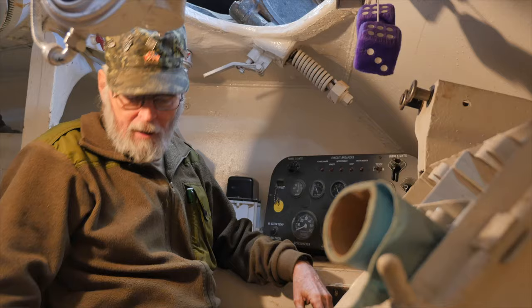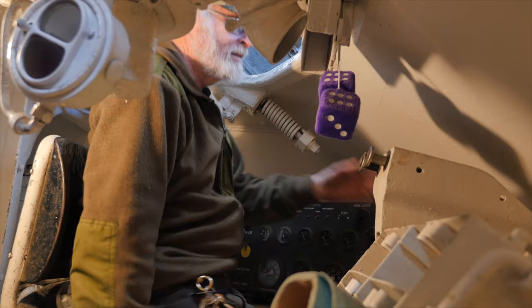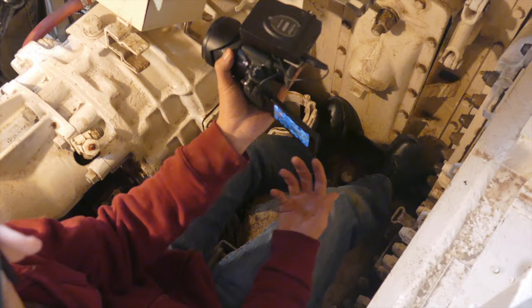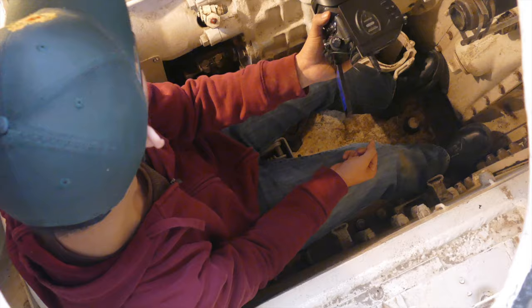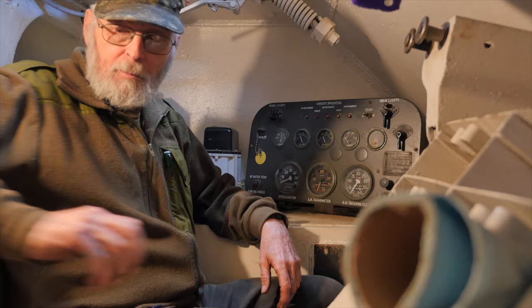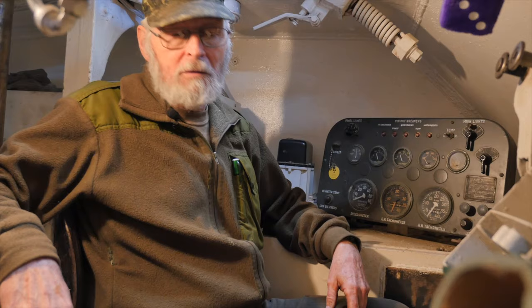With this seat I'm in the hatches-down position, but I can go up and drive so I can see out the top — or in the middle. Just depends on your height. Thanks a lot, Frank. But just sitting in here — this is exactly what we were talking about when we said it was hard for smaller people to drive the tank. For me, there's no way I'd be able to reach all the way forward to grab the tillers, and probably the gas pedals too. Frank notes the tillers aren't that bad — you can lean forward — but with shorter arms the long throw of the gear lever going from first up into second is a real problem. They've got a guy who's six foot seven, and they call him Shorty, and he can drive it fantastically because his arms are so long — he has no trouble at all.